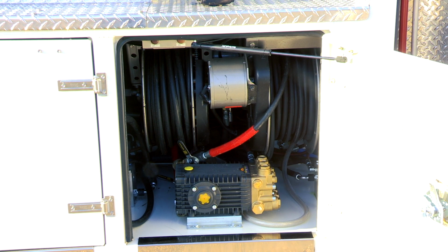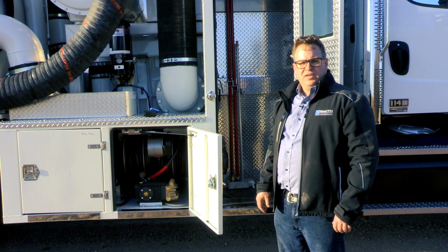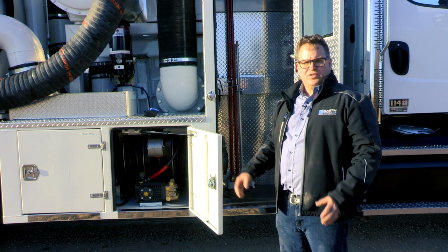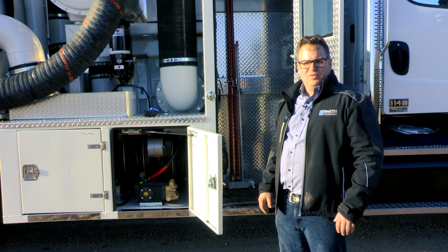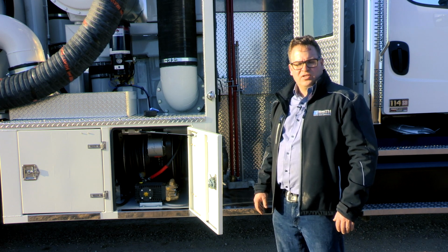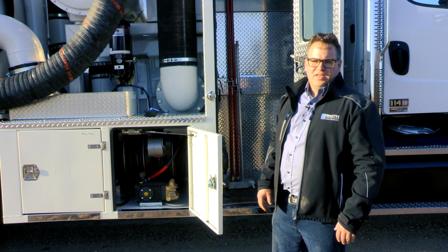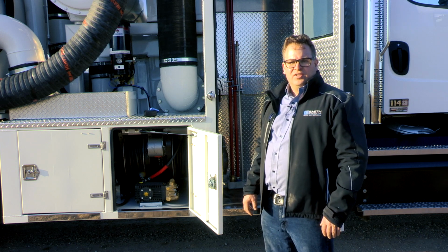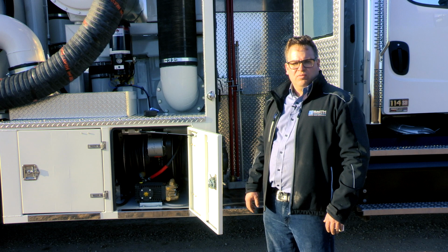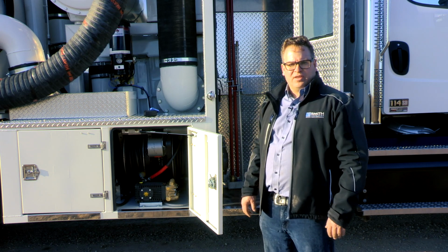So with the two pumps and two boilers, the flow can be separated for two guys hydrovacing, or it can be combined if you want 20 gallons a minute out one wash line. Or you can separate it and run one pump and boiler and circulate back to tank in cold weather while still hydrovacing with the other pump.